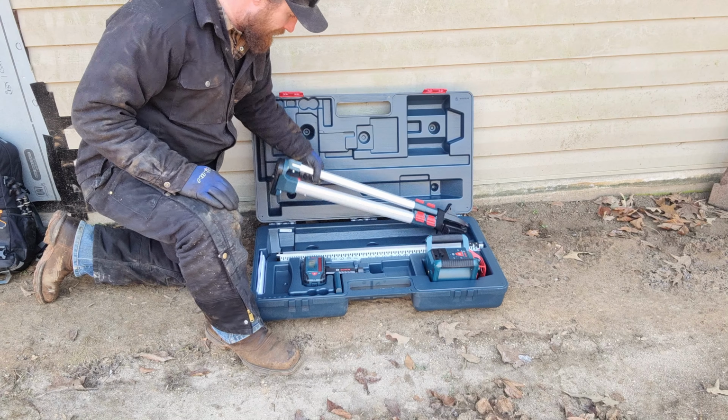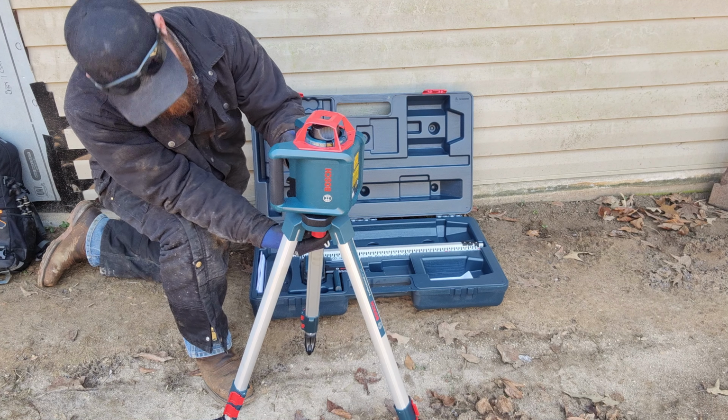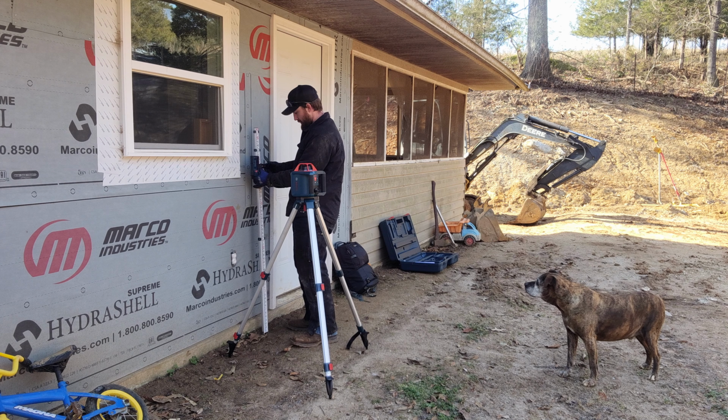So our main project for today, we've got to get the backyard here behind the house graded out a little bit more. We're going to be working on shooting some grade elevation to make sure that all this water can come out and it doesn't stay a soupy mess all winter long. We've got some more rain coming in the forecast. It's dried out just a little bit. It's still a little bit muddy, so we're going to try to push this dirt around.